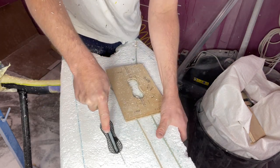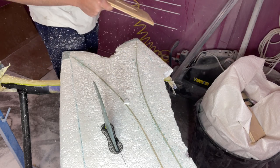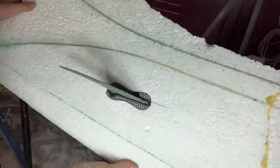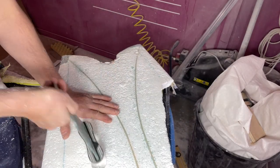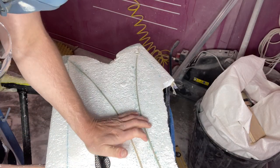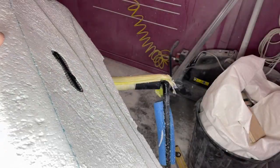And now we do a dummy fit. In this fit you can see that line is running on the inside foil of my fin - that's the correct way to install a side fin. Obviously if it was a middle thruster fin, that line would be directly running straight into the middle of your fin. You can see it fits very snugly, very professional looking, no big gouges out. This makes your board look so much better. Taking the time to install the fin boxes correctly will make your board level up. I might have sat that just a little bit too deep - half a mil maybe higher - but pretty bloody good for a first shot.